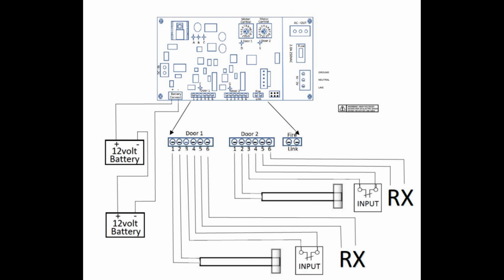Okay. Now, we talked about the motor controller or the potentiometers. The way the motor works is that there is a default travel length equal to 33,630 steps. Each step represents 5/8 degree of rotation in the worm screw, and so on.